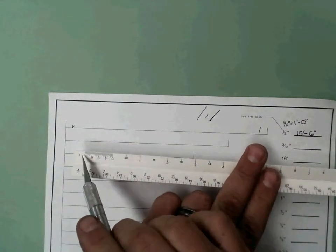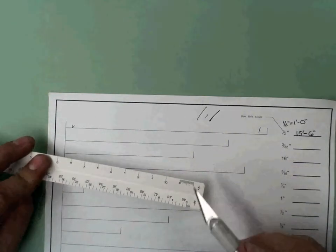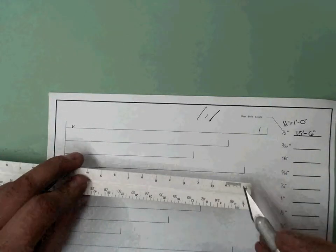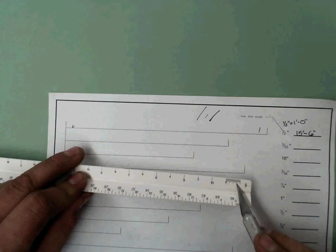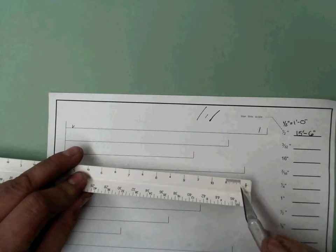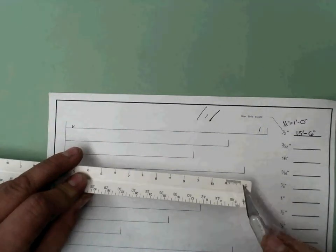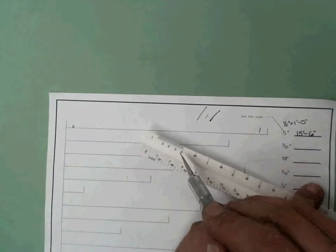Over here, that 12 inches is on the left side of the scale, so they're going to go that way. Some of you may do this scale, and I've got a bunch of highlighted stuff, and it's because you're thinking that that's 3 inches. But you've got to remember, that's the 0, so that must be the 3 inches, right? You're going to go 3 inches, 1 inch, 2 inch, not 0 inches, 1, 2, 3, 4, 5, 6, 7, 8, 9, 10, 11, 12. Oh, that says 0 because you're doing it backwards. Make sure you look at your scale and what side of the 0 you're on.